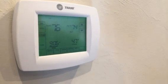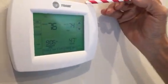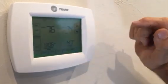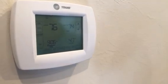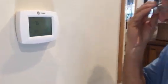Okay. Now, you see this wait button? That's the reason I've done this. These things automatically come factory preset for a 5-minute delay. So when you see this wait button, don't call your AC guy, or don't get all freaked out because it didn't come on, because you have a 5-minute delay. I always tell my customers, call me in 10 minutes. If it's not working, I'll be over to your house to see what's going on, okay?